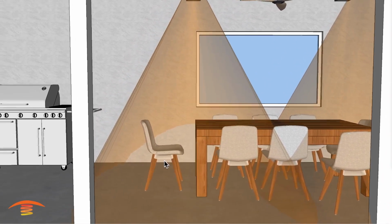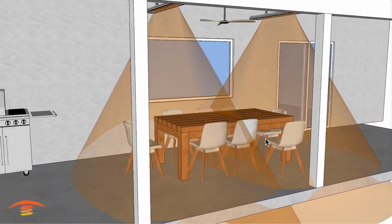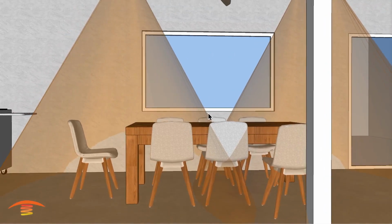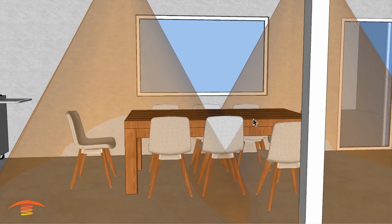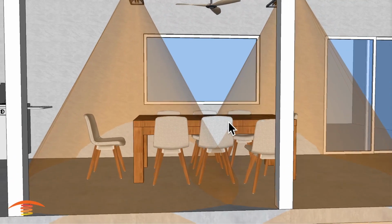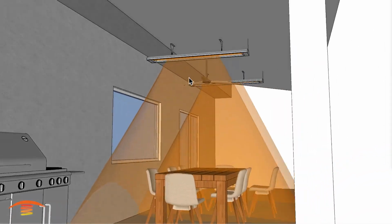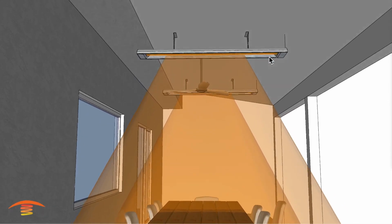I also pulled this chair out here as well, so you can see that that would cover this space here fairly decently. We are missing a little bit here in the center, but there will be rays that stretch out here on the left and right side. They're just not the ideal amount of heat that you're going to be wanting when you're actually in the ray. But when you have two rays that are crossing over like that, you may feel a little bit more comfortable there. Also, with a 6,000 watt unit, definitely you will need a control system for that.